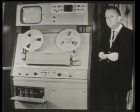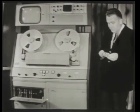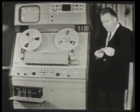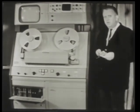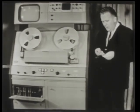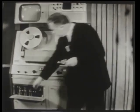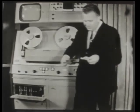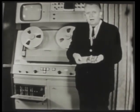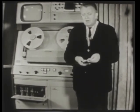What if something goes wrong? The answer is yes, individual components can be repaired. But the circuitry and components are both derated so that failure is very rare — instead of being loaded to or near their limit, they work at only partial capacity, meaning a long and trouble-free life. But if a failure should occur, the individual components are very easily replaced. In addition, with the use of this extender board, the circuit board can be put where it's easy to reach and test while working under regular operating conditions, which adds to the ease of maintenance of the VR-1100.